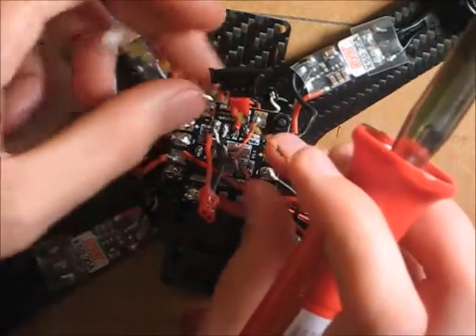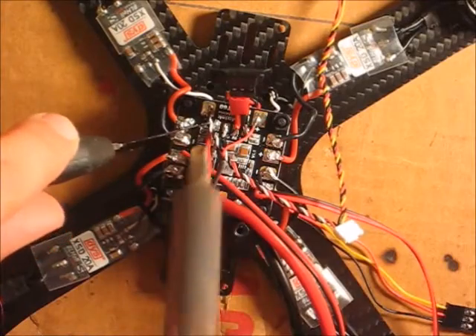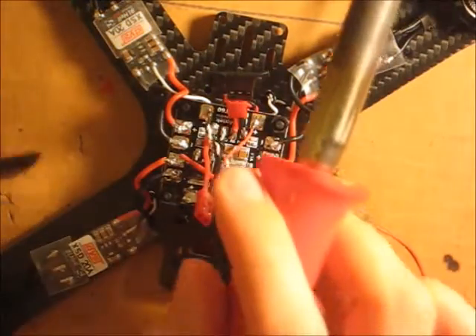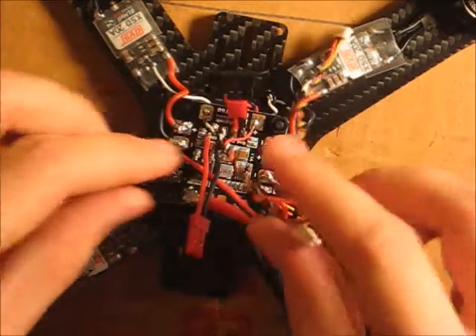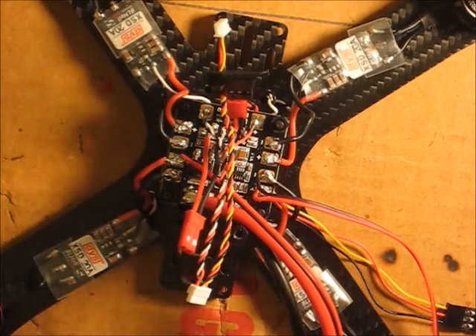And now for the audio and negative wires. Grounding the audio is required to help so it doesn't lead to as much interference with other people's video — because if the video transmitter is trying to transmit audio, you're going to be broadcasting more over the air than you need to. Holding that down and just letting it flow in together. And there we go. So we have this part which will go into our video transmitter, and then this part which will go into our camera.